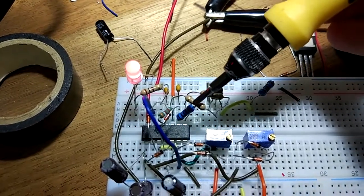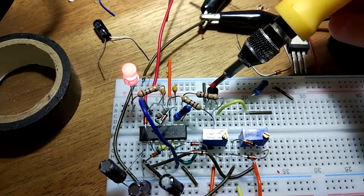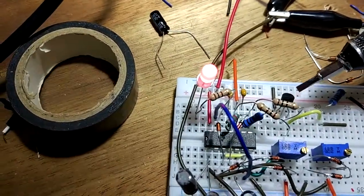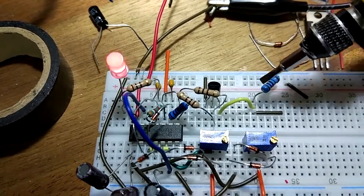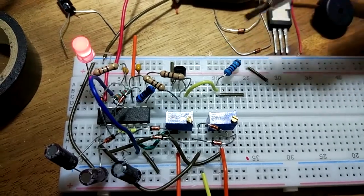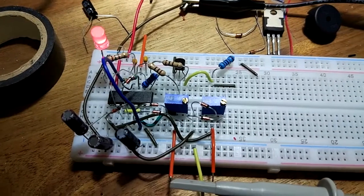of the two oscillators, I guess summed together with these 100 ohm resistors into this. This is an NPN. I couldn't find any MOSFETs lying around that were the right size, so I just used an NPN, fine, and that's switching the piezoelectric buzzer on the 3-volt rail. Actually, it's plugged into the 3.3 at the moment through my hacked computer power supply, but it's meant to run off 2 AA batteries, so 3 volts.